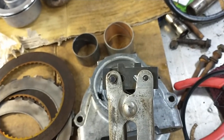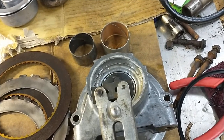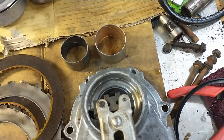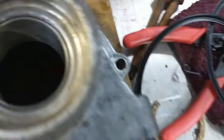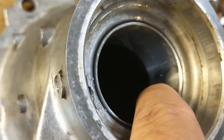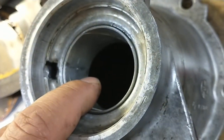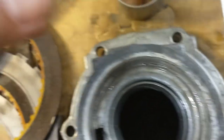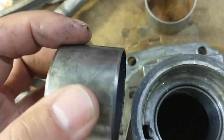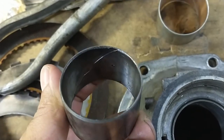Then you just give it a good squeeze, and you can see those blocks move out. There are little pins that drive through the bushing and kind of dent it into the wall of the housing — it pins it in place. You can see an indent on both sides, which holds it so it can't loosen up and spin. This is the old one — it doesn't make it impossible to press out, it just flattens as you press, but you can see the stakes there.